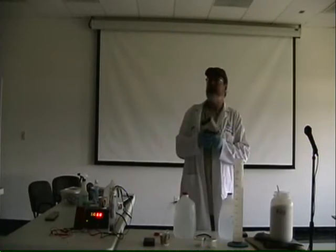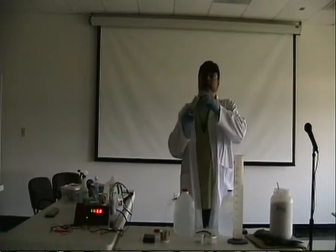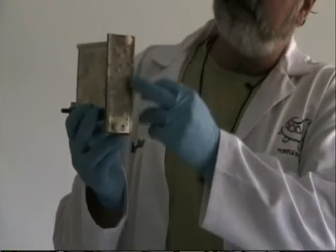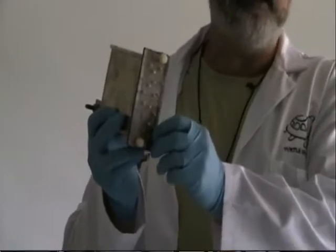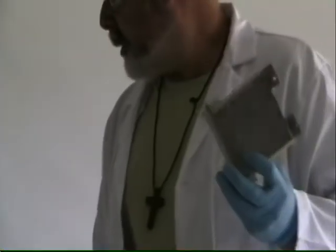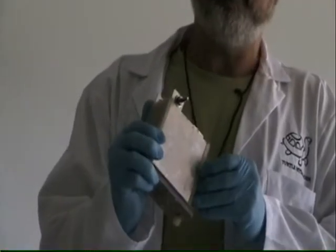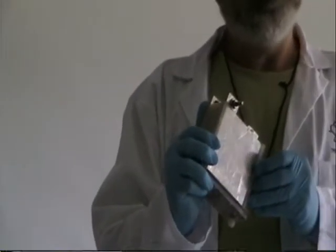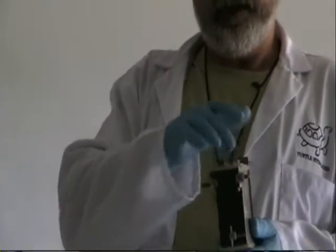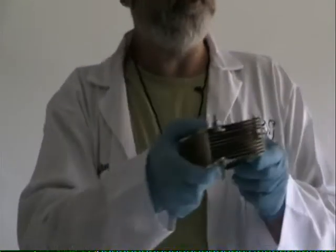In the meantime, I was looking for the best way to make a standard series cell work. This is a standard 11-plate series cell, one-eighth inch spacing. On the bottom, I drilled a hole to cap the bottom to prevent shorting across the bottom. I put a plate across the bottom with holes strategically placed so that there can't be much shorting. I also found an industrial adhesive designed to bond stainless steel to acrylic or polycarbonate that will survive a caustic environment. I use a table saw with dial indicators on the fence to cut the grooves and set the plates in. The plate tolerances on this are within two or three thousandths.